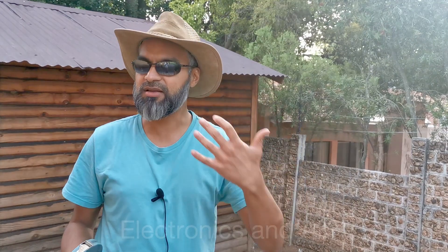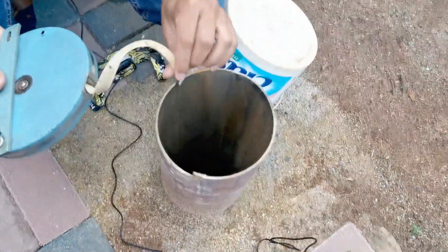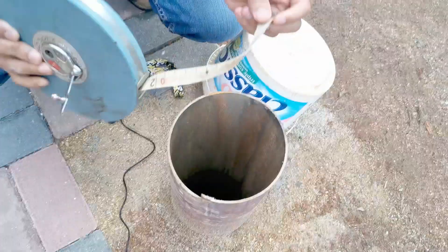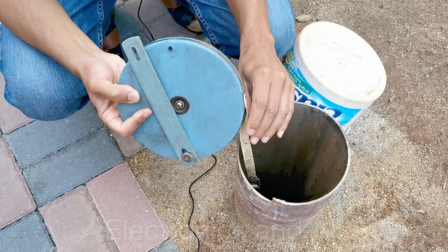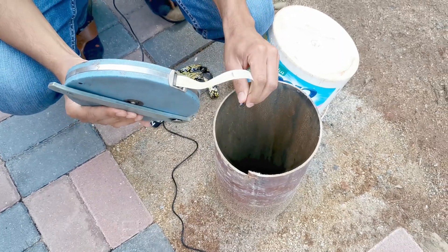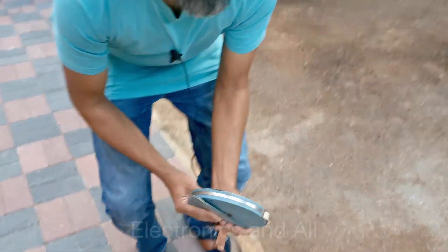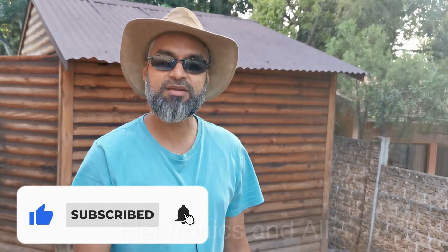Some people just throw a stone in and let it free-fall, then listen out for the splash. But with this tape measure — if the static, which is the head of your water meniscus, is quite high — this is a 30-meter measuring tape, so you can drop it into the well and watch when the tape actually hits the static and get the reading from there. That will then determine the size of pump to get and what the water reserve is within the borehole.